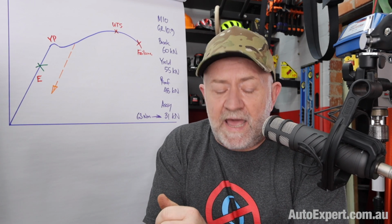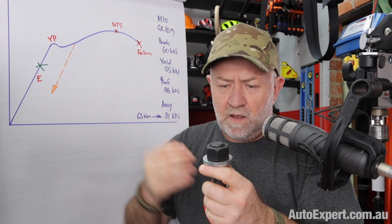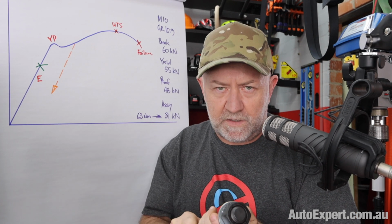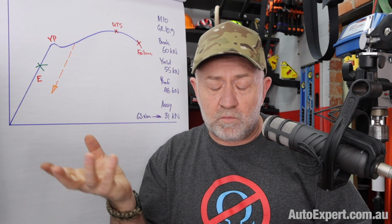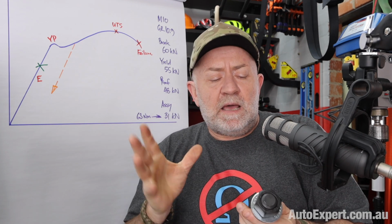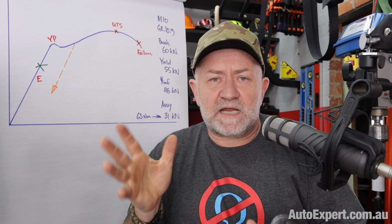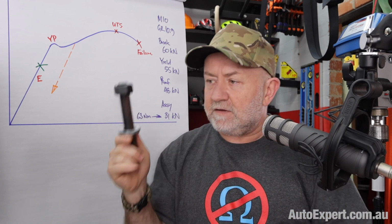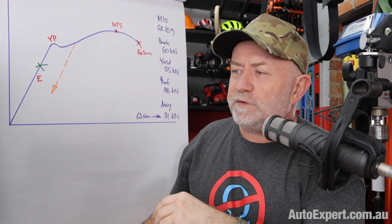And it's far more accurate than a torque wrench because friction is effectively sidelined. You're looking at mechanical travel of the nut down the bolt or the bolt into the job, whatever. And it could be harder to achieve that 90 degrees or whatever angle you need, or it could be easier if the parts are lubricated, whatever. But it's going to be the same amount of stretch, which is ultimately what you're after here, right? So if you think that's the ultimate, I've got news for you.